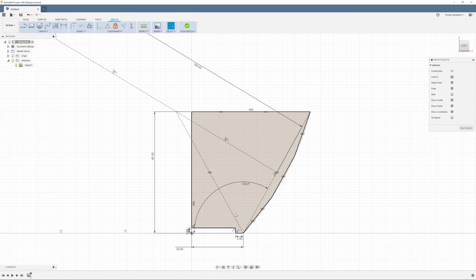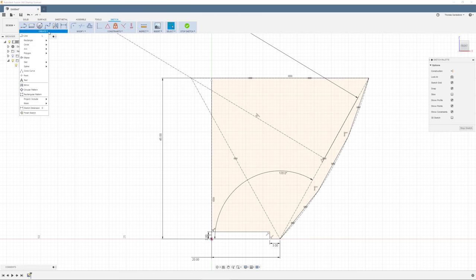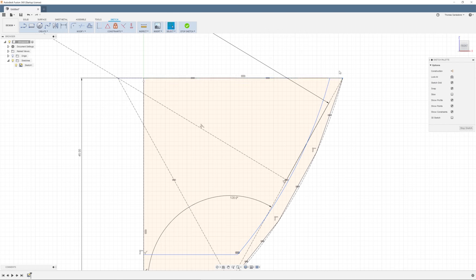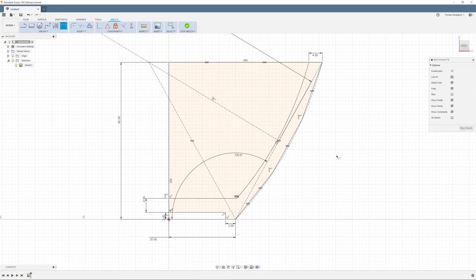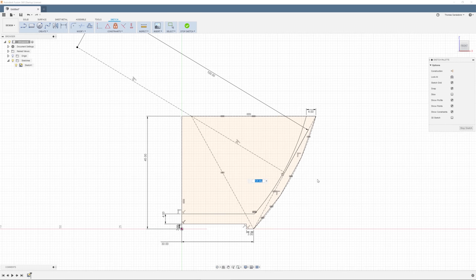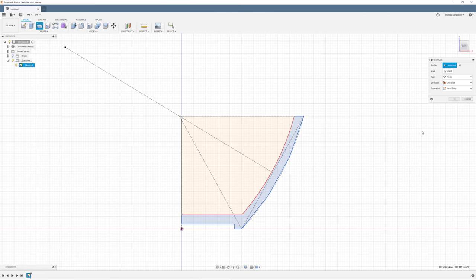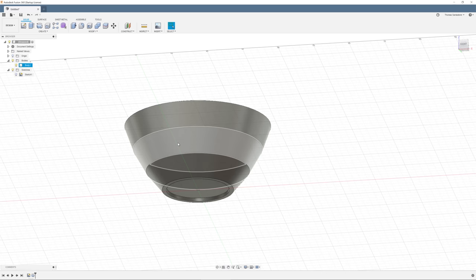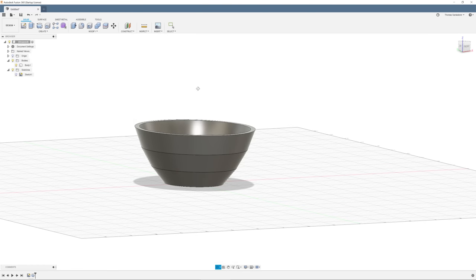For the inside geometry, there are a ton of different options. Some of the ways you could do it is to either use the shell feature on the actual 3D geometry or to use offset inside the sketch, but since I didn't need the faceted look to be transferred perfectly to the inside, and rather was going for something smoother — aka easier to clean — I just decided to sketch the inside geometry separately and set some wall thicknesses manually. You could do this all parametrically, but since I'm not planning on this design to be adaptable — this is mostly a one-off part for myself — I'm fine with just leaving the dimensions in the sketch.